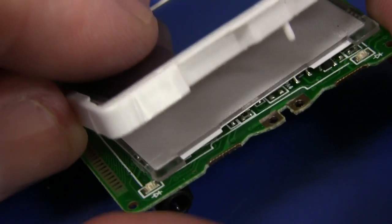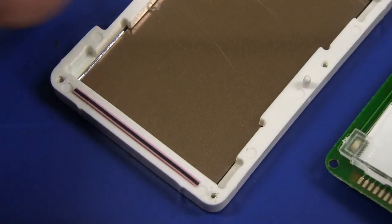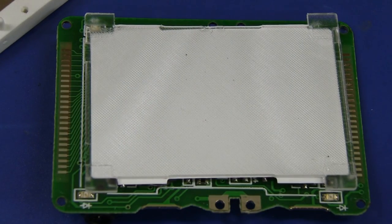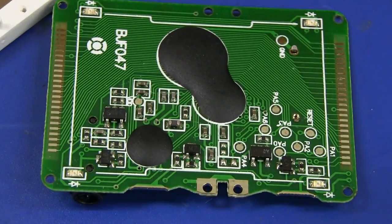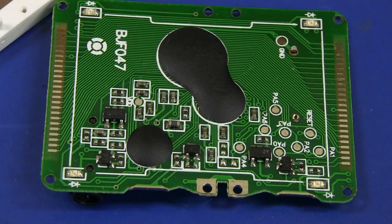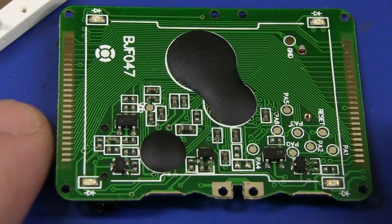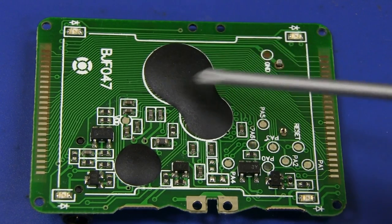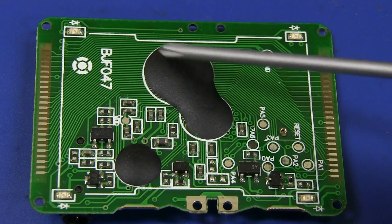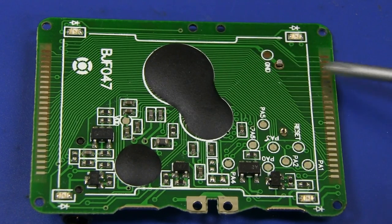Let's take this LCD off - of course we're going to have some zebra strips connecting it. There they are, integral to it down in there. They've got a light pipe and just a blob. Not that exciting. There are four side-lit LEDs. I was hoping to identify the micro or something like that, but nah, just a blob. Looks like we do have a three-chip solution - obviously there's the LCD driver part of it, and the main part of the watch is under there just driving all the LCD segments. It could just be a micro they pre-program to go to all the LCD segments.